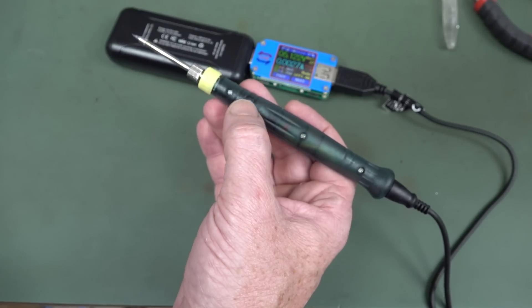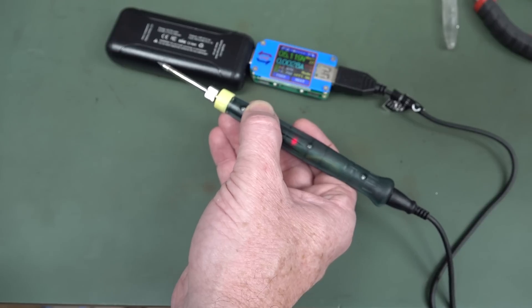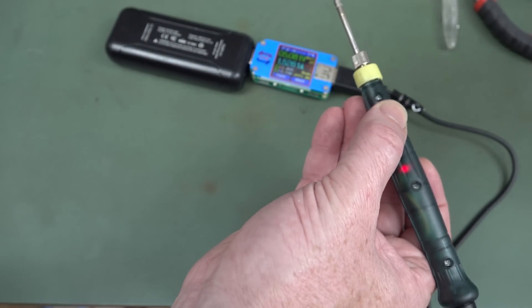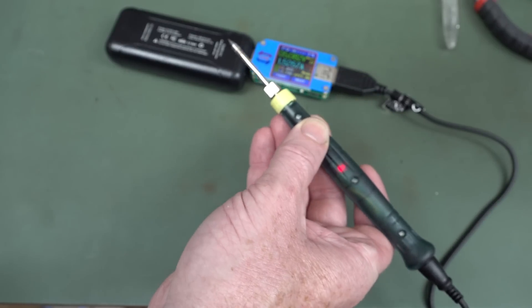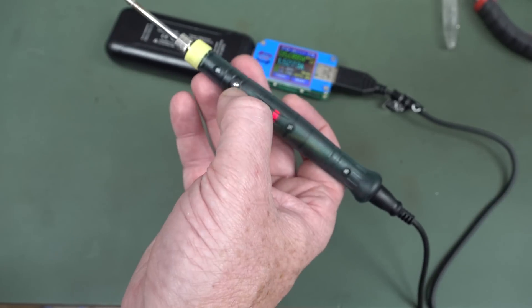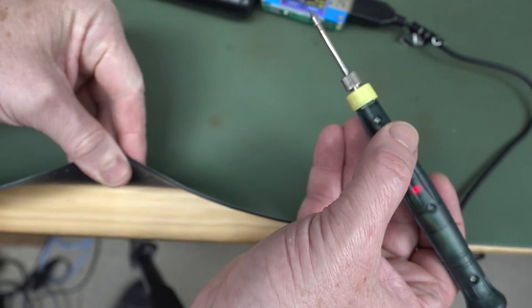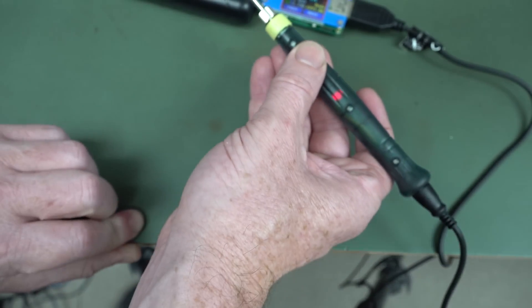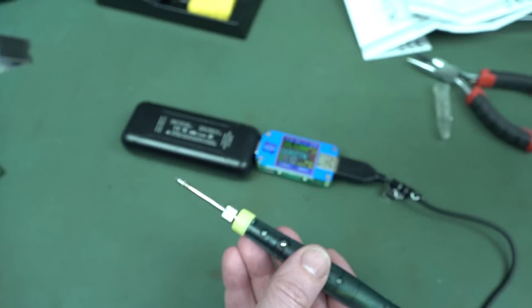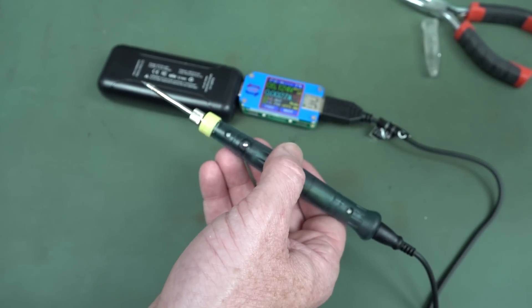I figured out this dodgy touch switch. As you can see it doesn't work — can you figure out why? If I lift my hand off the bench, look at that! It's because my hand was touching the static dissipative bench. It just bleeds the charge away. There's not enough 50 Hz pickup on there to make this touch switch work. And it's worse if I touch the conductive black backing on the mat — vastly lower impedance going to earth and it doesn't work. So you cannot use this stupid thing with an anti-static wrist strap! Unbelievable!